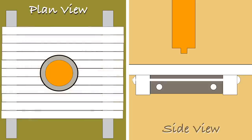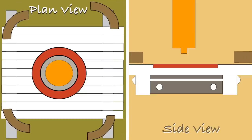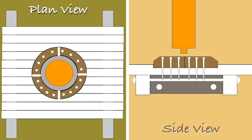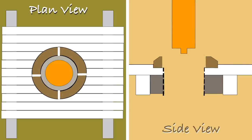Back on deck, a wide ring around the hole is rebated with a router. Into this, an oak collar in four parts is snugly fitted. The joints of the collar are drilled and doweled with stop waters to allow any unwanted water to wick away on deck. The hole is now rock solid above and below the deck, but barely touching it.